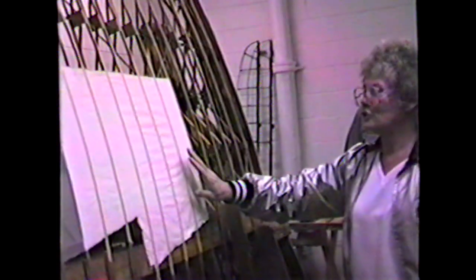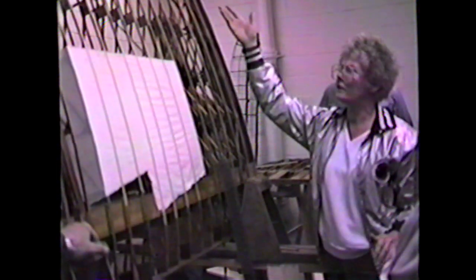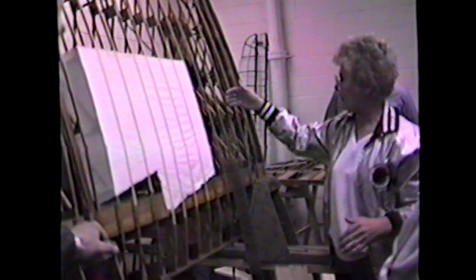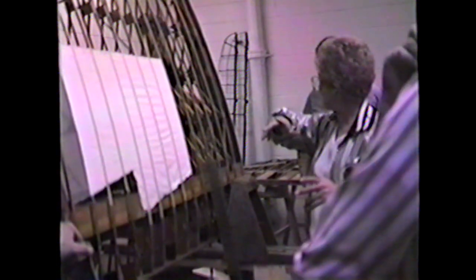So within another week or so, we're going to coat it with tautening dope. After you've pulled up your fabric, it will probably look something like this, real snug, straight, all the way across. Then what you do is you measure off from the leading edge to the trailing edge. This looks equal on both sides. On a wing you would have gone up to the minimum on this because you got the 1 inch. Yeah, we got the fabric right there.